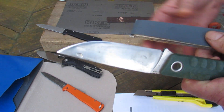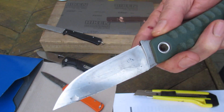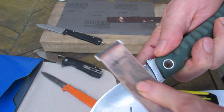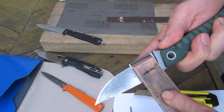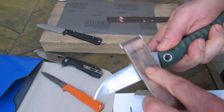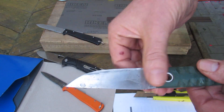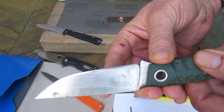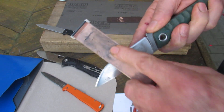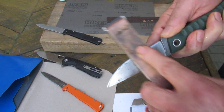If I just go over the top of this with some new sandpaper — this is 2,500 grit, I've just cut some off. It just behaves differently; the grit on the sandpaper is just completely different to the grit on those diamond stones. Where the grit sticks out more — see the black there? That means steel has been taken off. It's starting to get polished up and it actually took quite a bit off. Definitely the diamond cuts really faster than the silicon carbide — there's no doubt about that.